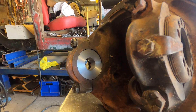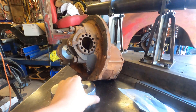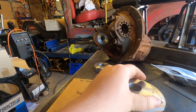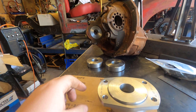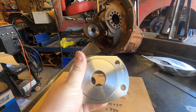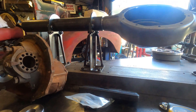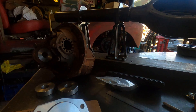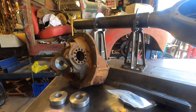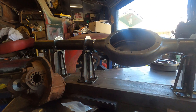Once it's cut down we're going to use these — I had these machined up, they sit in the caps pretty well. 30mm internal hole, and also these ones which go into our Ultra 9 bearing ends. They're a nice tight fit. A bit of 30mm round bar and 30mm threaded rod going all the way from bearing end, through the third member, to the other bearing end. It should help hold it straight while we weld it. I'll cut these tubes down, do a little bit of a fix up on these saddles, and then show you how to put the studs in.